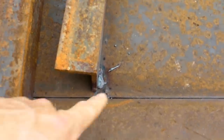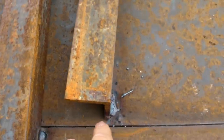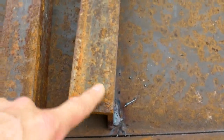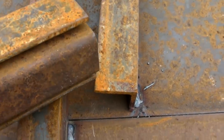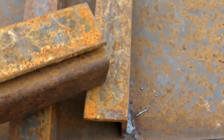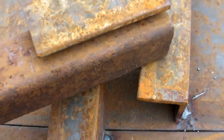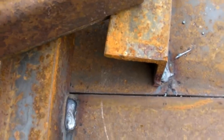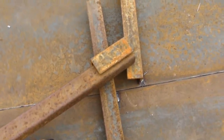I'll show you how this works — I've got one here that I forgot to weld down one side of. I don't like doing this type of operation because it requires me to lift this sheet. Normally I'd try to push the sheet down but there's too big a gap. So I welded on a temporary piece of angle there. With our tool you can hook one of these notches underneath that lip on the angle, then rest it over the Strong Back you're going to weld down. You can see how easy it is to move that sheet. I'm just using the weight of the square tubing, not even pushing down yet — but if I needed to I can push down and give as much force as needed, then hit it with a weld.